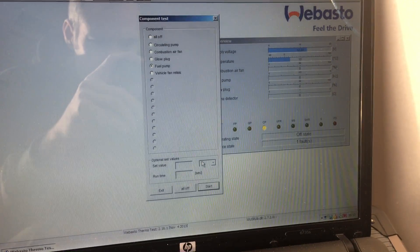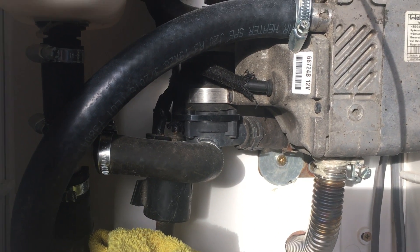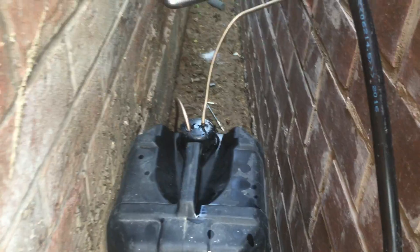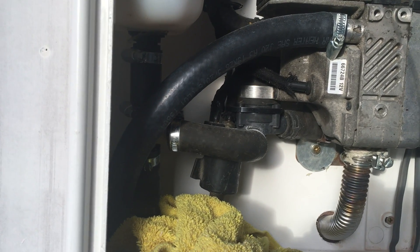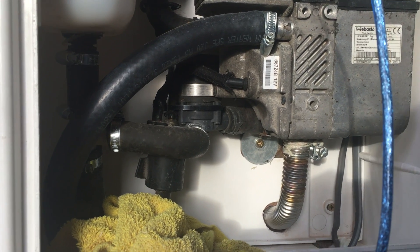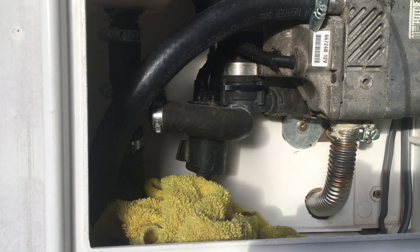Just run up the fuel pump for a few minutes — about 20 seconds should do it. That's running at 5 Hz, which is turning on and off 5 times a second. I've got my fuel supply outside: a 20-litre drum with diesel, with a breather and exhaust from the outside as well. Because I've had all that off, the fuel system needs to prime. Otherwise, when it comes to combustion, it'll stop. I can hear the pump's note has changed slightly, so I can hear it's primed up. We'll stop that, exit it, and knock the system on.